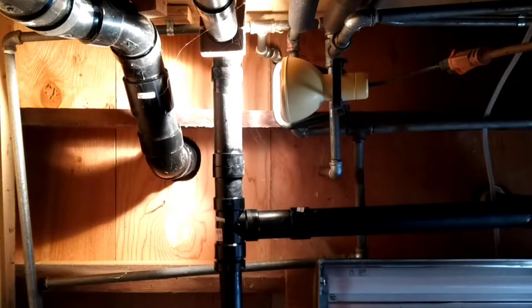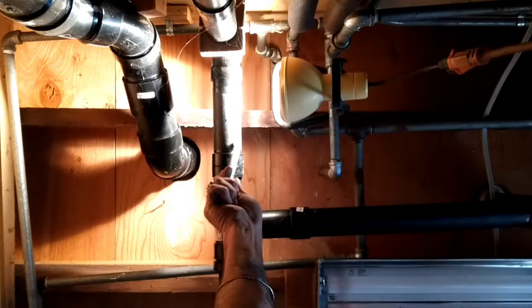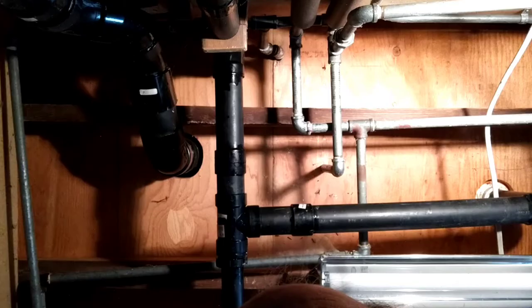You can see this has been replaced a few times. This is the drain right here for the toilet — it's a big one. So what we're concerned with is replacing this broken pipe and collar here, and this broken pipe and collar here. This one's still good but I still have to cut the T out. I don't know if you can see it — let me try to point the light a different way.